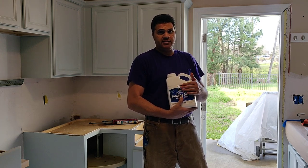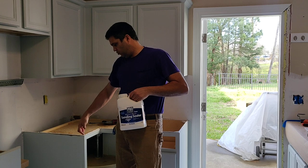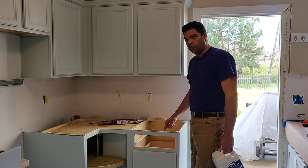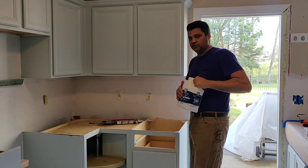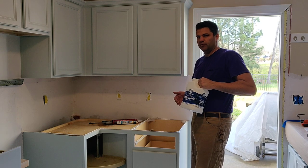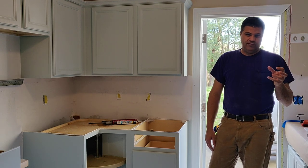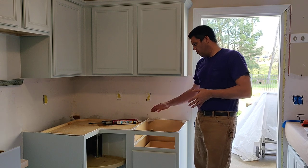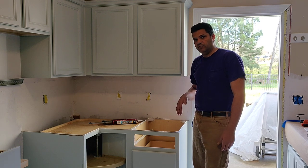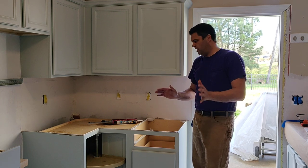and you use an adhesive that works with the cabinet laminate plywood and the hardwood. It's got to work with the plywood, which is what the end panel is, and the red oak hardwood. And it's got to work with whatever this is, which when it dries leaves a kind of polyurethane film on the bottom that you can sand and put poly on. But water won't go through it easily. So if you're using a water-based adhesive, it might not stick to it. It'll work with a sanding sealer type chemical and these other two substrates, which is why it's way easier.